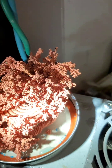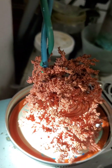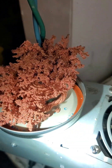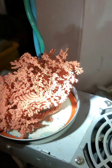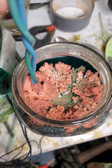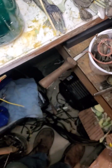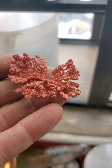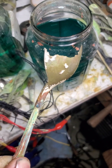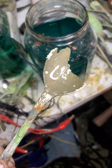This is from last night. It started out at 12 volts and then I kicked it down to 5 volts. The higher voltage makes bigger branches, and then the lower voltage kind of fills them in and makes it beefier. Pretty neat. The copper cell is absolutely dissolving the spoons slowly, and it's leaving the silver behind — any leftover silver plate is just flaking off into the filter basket.